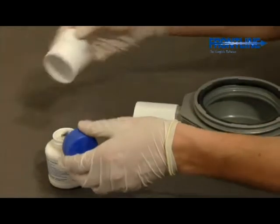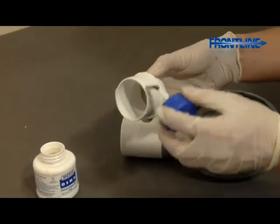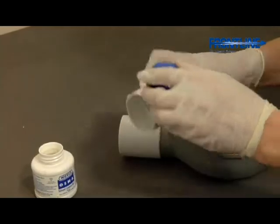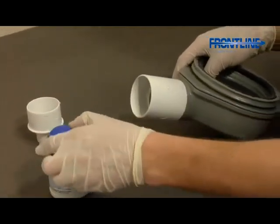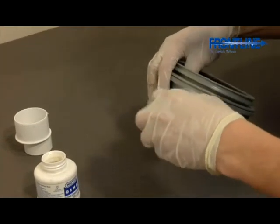The pipe moulded to the trap is a 2-inch standard solvent pipe and has a built-in 3-degree fall. Firstly, you need to fit the 2-inch solvent connector to the trap in order to then connect to the rest of your waste pipe. We also supply in the kit a 2-inch to 1.5-inch reducer should you need to connect to a 1.5-inch waste pipe.